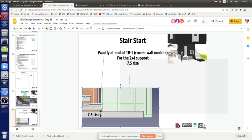But really thinking about how you finish this off, I would put the second tread at the very end after the interior finish is done. Otherwise, people walking up and down it, dropping things on it, we'd have to basically sand them afterwards. So let's avoid that and put on only one. So we only need to cut 15, not 30. But we should cut the 30, but install the 15 for now.